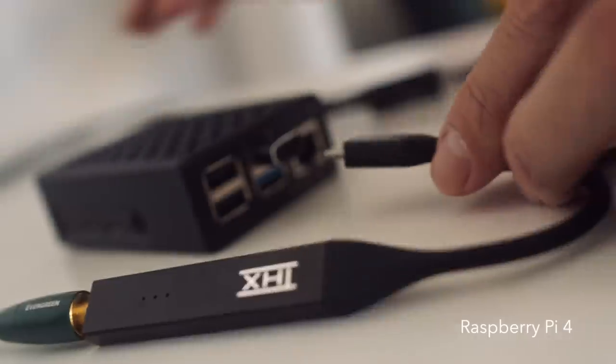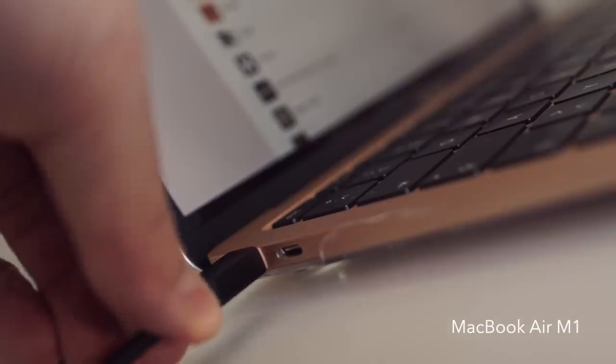Now I'm back at home, and one thing I really like about dongle DACs is how easily they go from being used outside to inside the house — you just disconnect from your phone and connect to a Raspberry Pi, MacBook, or PC laptop. However, only the THX and the AudioQuest really apply here for home hi-fi use, because the Helm Bolt has auto-impedance sensing. If the connected device is less than 150 ohms it drops down to 1 volt, and I've noticed it drops to 1 volt when connected to quite a few integrated amplifiers — so it just becomes too quiet for most hi-fi loudspeaker systems.